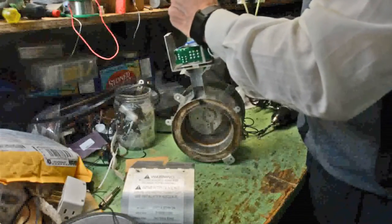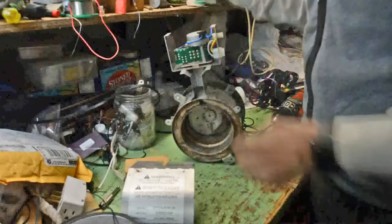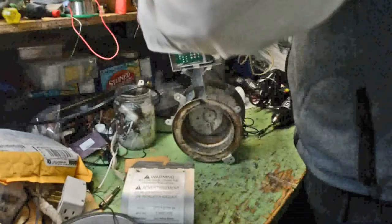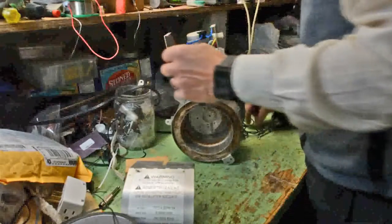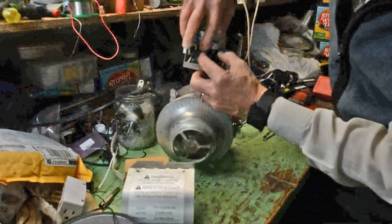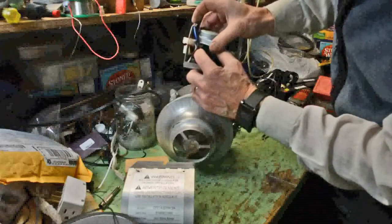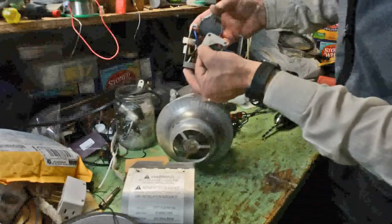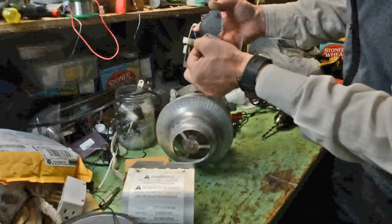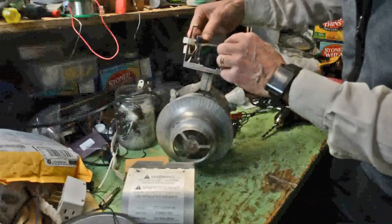This is what we want to do, is access that control circuit board, the green thing with the shiny silver dots. That grid of 3x3 dots represents the connections for the 3 micro switches, one of which appears to have a fault. The cam, which has 3 lobes on it, serves as a coupling between the gear motor and the flap valve itself. That Y-shaped piece separates the circuit board and also has a pair of pins on it that help hold the circuit board in place.